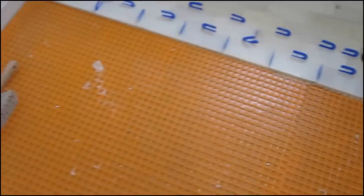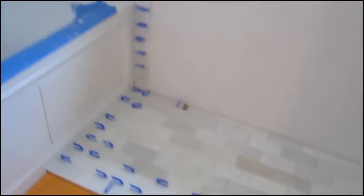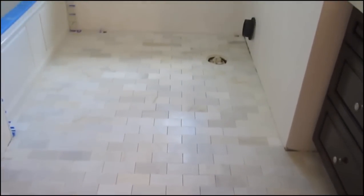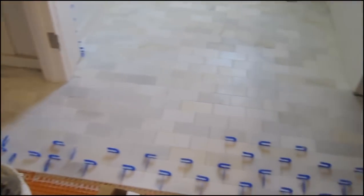This marble tile is very porous, so before you grout it, it needs to be sealed. On the floor, we've got the same pattern as on the walls — subway 3 by 6 running bond — so the walls and the floor are the same material. It's simple: no borders, no nothing, just a couple of shelves in one corner.